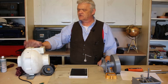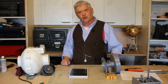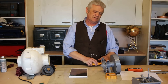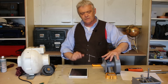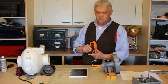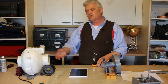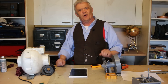Here's our setup. What I've got here is a fan blower. That fan blower takes a little bit of time to get to speed, but when it's up to speed it'll blow out a column of air at about 2.4 meters per second — I know that because I read it on an anemometer placed right there to read that wind speed. We'll give it 10 seconds: hold on, start it, let it get up to speed, set the timer going, let go for 10 seconds, and then take an RPM reading of the flywheel using a laser tachometer. It's got a little reflective strip on the back for that. The 10 seconds and 2.4 meters per second are both important and we'll get a reading out of this.